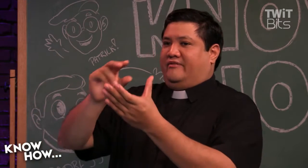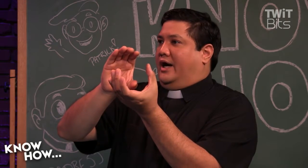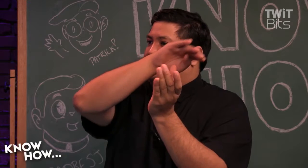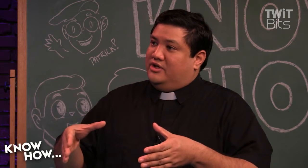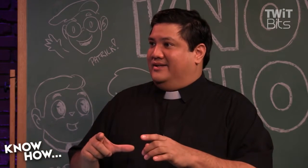In a regular speaker, you typically have a magnet inside of a coil. When I energize the coil, it pulls on the magnet. A wave energizes the coil, which duplicates that wave and moves the diaphragm of the speaker, generating sound. In a piezo-electric device, I don't have a magnet and coil — all I have is a material, typically a ceramic, that when I apply a charge to it, creates mechanical stress, vibrating the material at a particular frequency. This ultrasonic transducer is 40 kilohertz, which I won't hear, but a dog will, and it will always resonate at that frequency.